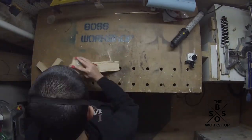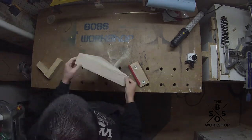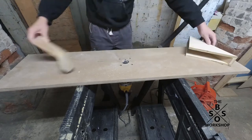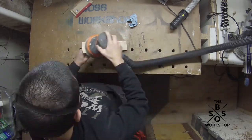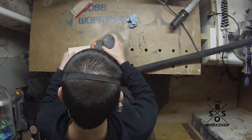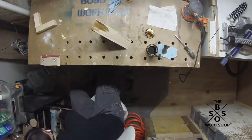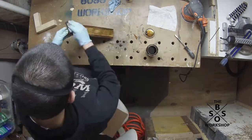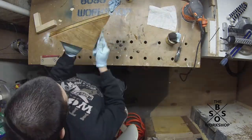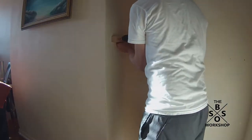Once that was dry, I came back with sandpaper and sanded down all the wood filler. I took everything over to the router and gave it a round-over. You don't really need to add a round-over to that 2x2 piece — I just did it so when I push the shelf onto it, it goes on smoother. After that, I sanded everything down to a final grit with my orbital sander and applied my stain.